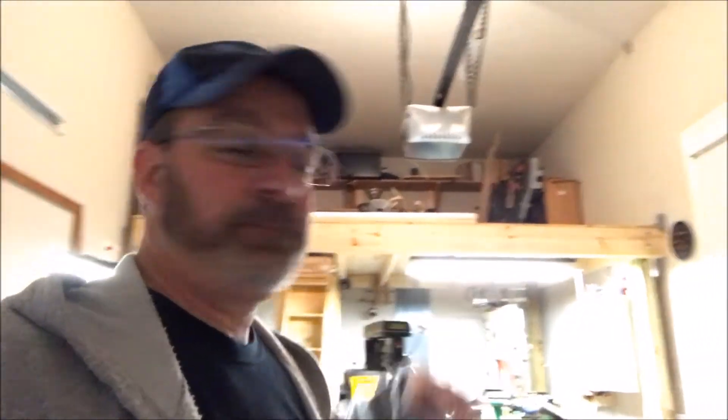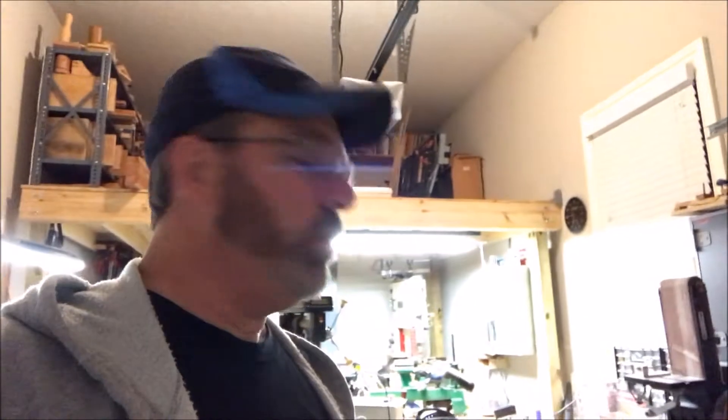It won't be used all the time, but it gives me a convenient occasional outlet if I need one. I've got a 20-amp breaker — that'll be three outlets and two lights on it. That shouldn't be pushing it because most of the time I'll be running one thing at a time. I've had the compressor running on a 20-amp outlet in the other garage with the refrigerator compressor running too, so if those two don't blow the breaker I should be okay running the compressor and maybe the vacuum cleaner. It just makes sense to have one up there for convenience.